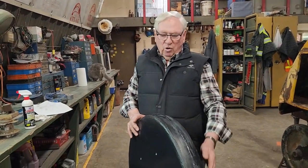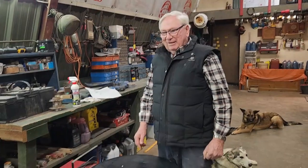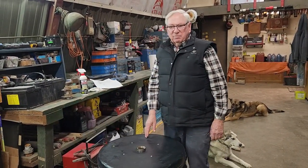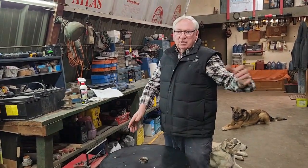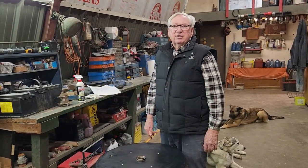So this has been field tested out in the field, but not with snow. You drove it through the field and cut power turns with my 16-year-old hat on, and we had dirt flying up and everything else to see what the side pressure would take. Drove it into the mud, and we pulled it out with a skid steer backwards with the wheel turned to see if it would pull the wheel off, and never bent it at all.